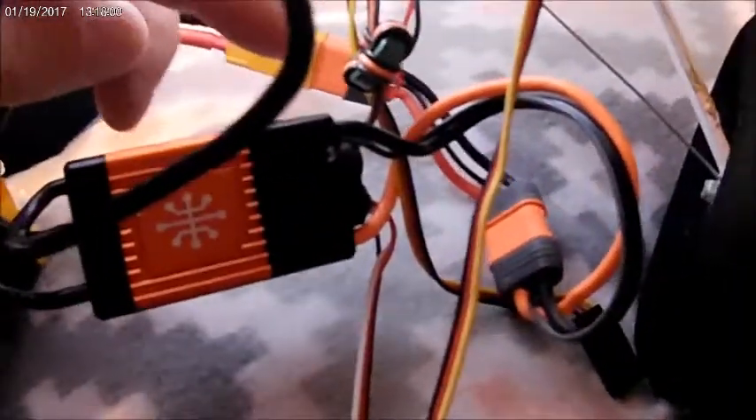You're going to have to disconnect the main servo or the speed controller lead from your receiver. I had to open her up and disconnect it, but so I don't have to feed it down through the hole to the front end, I just plugged in a servo extension, male to female. I was able to plug that lead into my program box — it says 'connecting to PC' — and your other lead on the speed controller plugs into your slot on the end of the speed controller.